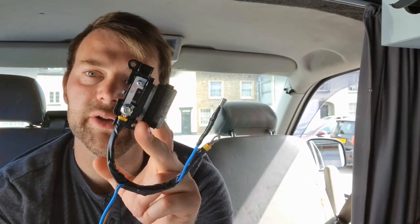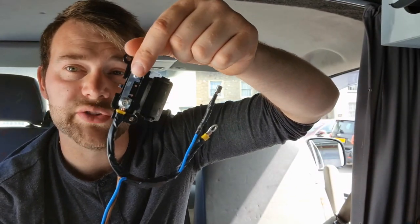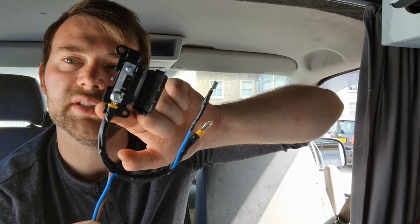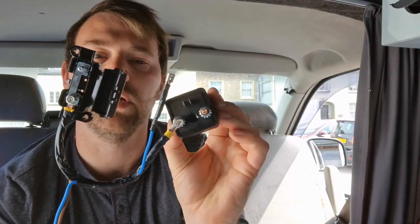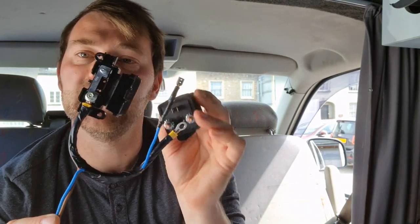So this is the business end of it. We've got this 100 amp fuse in this fuse holder here. The live from the battery, the spade terminal, which is now down by the fuse board, which I was just talking about, is going to go onto this one here, through the fuse, around here into this big spade connector, which is going to be going into that side of the relay. The other side is obviously then going to have a link from there to the fuse board.